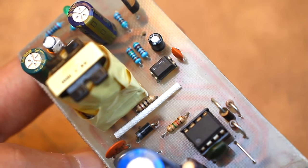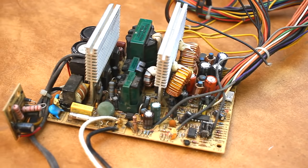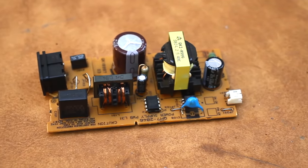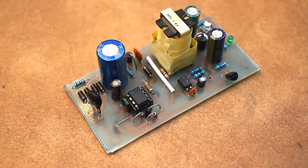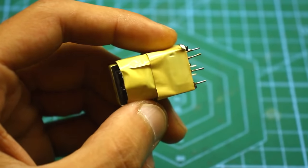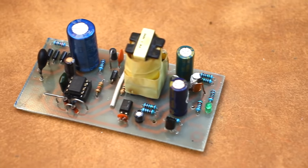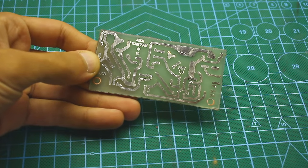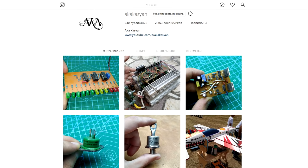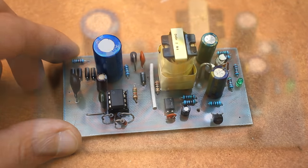Is it worth it? In my case, yes — I didn't spend a dime on this unit. On a separate board, you can assemble a standby-mode circuit using components from almost any computer power supply and use it for your needs. Naturally, it's easier to just buy the necessary power supply, and as a rule I do buy such units, but sometimes it's worth exercising your hands and brain. At maximum current values, the unit operates without any problem, though there is some heating of the transformer, PWM chip, output rectifier, and choke. In the device where it will be installed, currents of 1 to 1.3 amps maximum are needed. All necessary links, including a link to the project archive with the printed circuit board, will be found in the description. Please don't forget to rate this video and subscribe to my Instagram. With you as always was Kasyan TV.